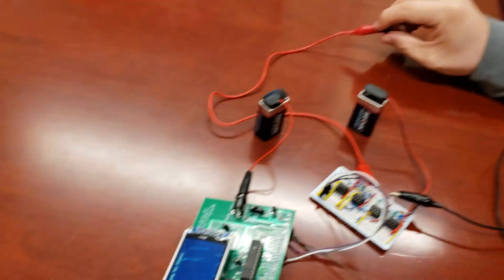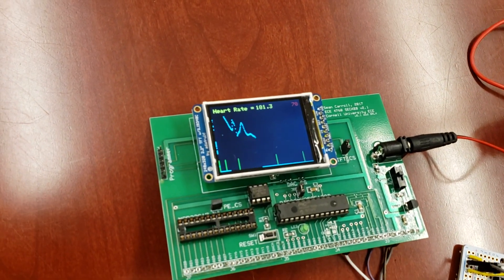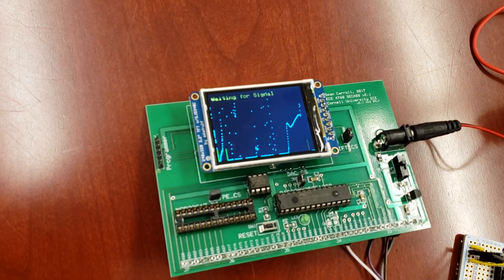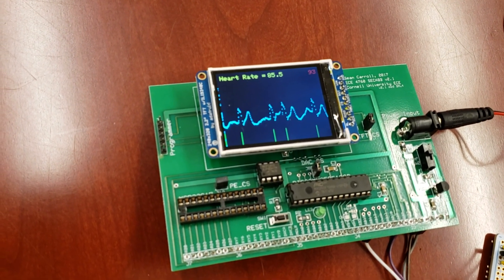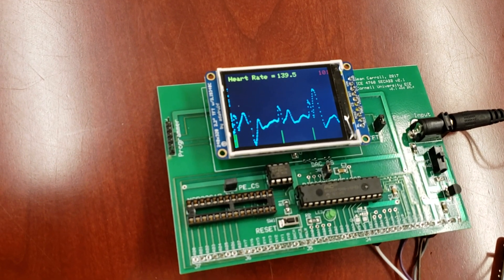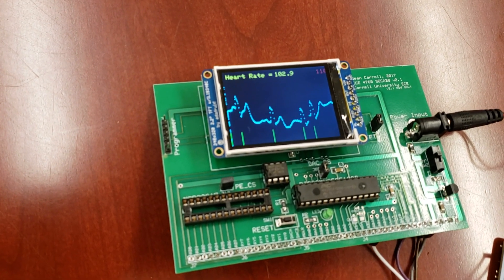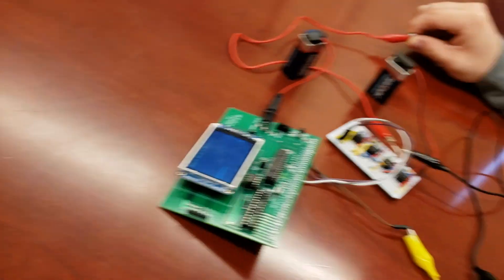Let's hook it up again and watch it come back to life. So now it's coming back after being just noise. It says "waiting for signal" because the baseline is not stable enough, and now it's got your heart rate at about 81 or so. This heart rate is determined only between peaks, so it's only determined by the time between each peak, and it updates every single time. That kind of allows you to see how the heartbeat changes when you're breathing.